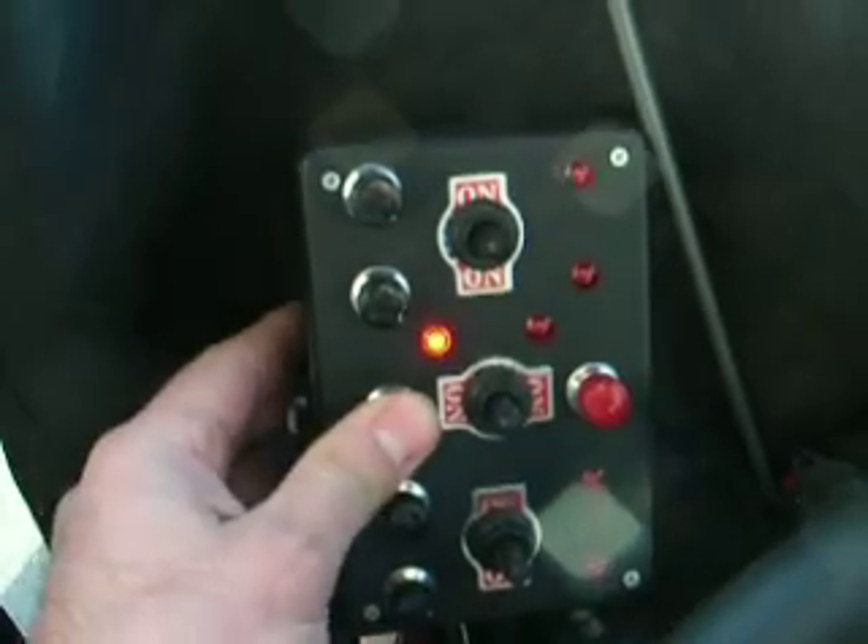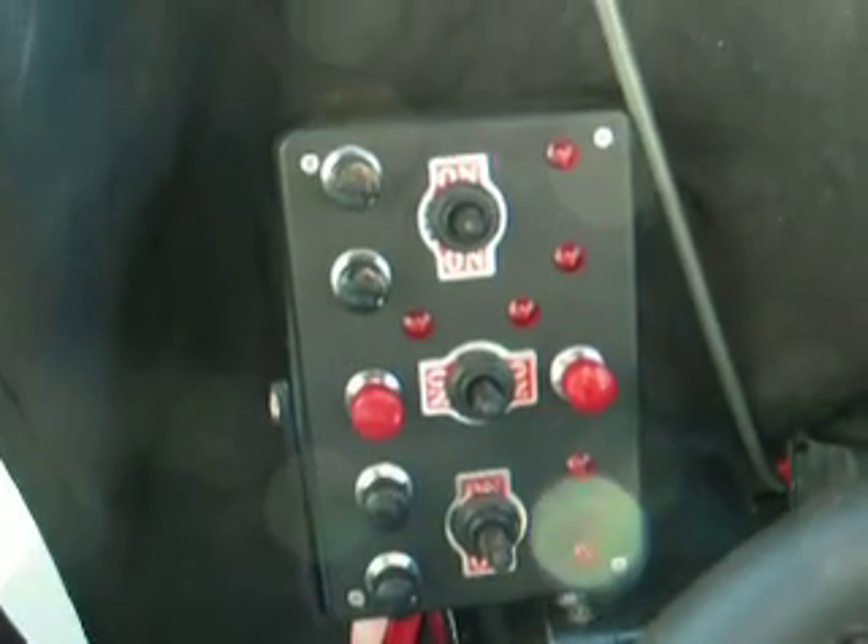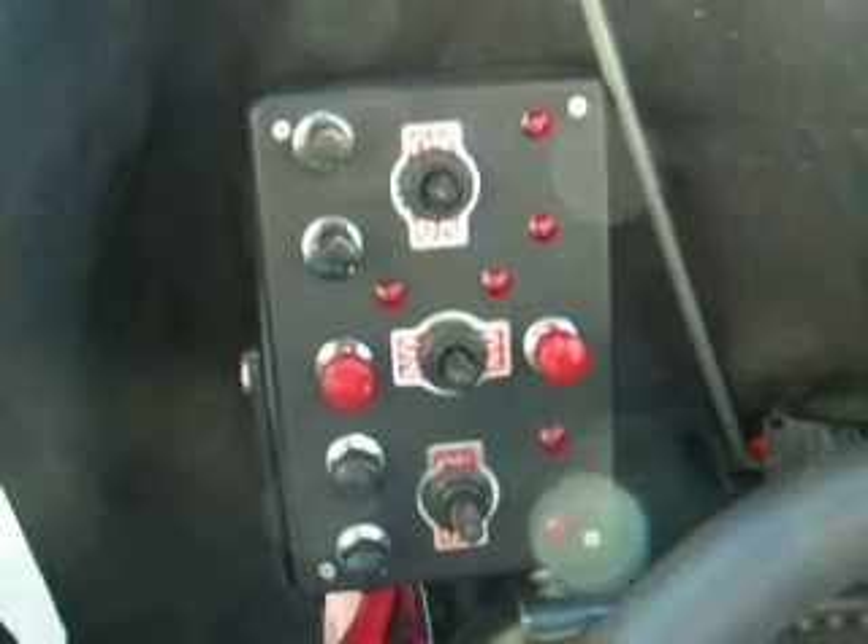Or I can make it go just a little bit. And then the angle up and down — I can make it go and leave it there. I found that during snow blower operation it's nice to have the actuator do its thing while you maneuver the tractor, reverse direction. By the time you're done reversing, the chute is already in the other direction you want, or the blower is up or down depending on what you're doing. That's why I went with both push buttons and hard switches, and I can do other things while it's moving.